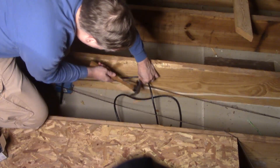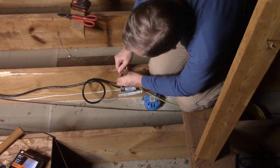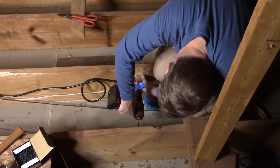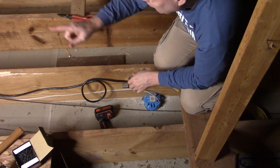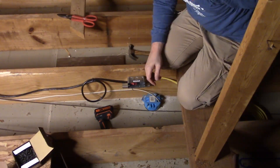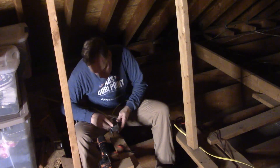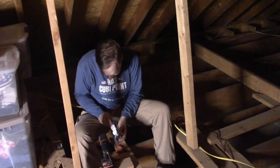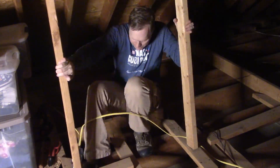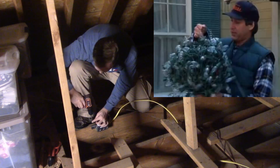The black cable from the garage door opener is nailed down to the studs to make sure it doesn't get loose. Then the cable is connected to proper house wiring with wire nuts inside a junction box — this keeps everything safe and keeps it from being accidentally pulled out or loosened. Then the receptacle is wired up — this is the one for the right side of the garage. A second will be wired for the left side. Both receptacles are wired in parallel so they don't interfere with each other or stop working if one of the two rotating beacons burns out. These aren't Christmas lights after all.